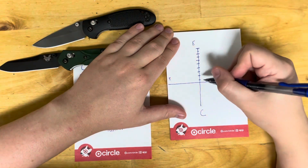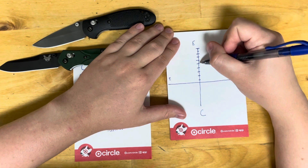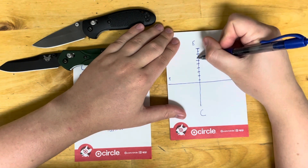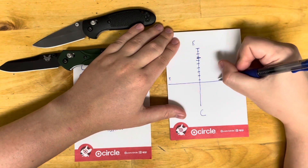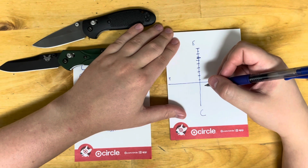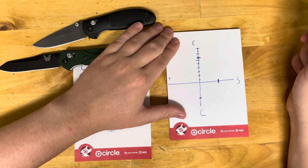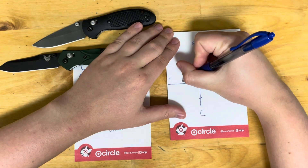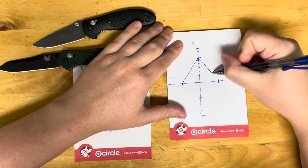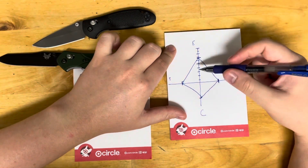On a scale where 1 is H1, 2 is like a 420, 3 is Aus8, and 5 is 154CM — S30V is about a 6.5 for edge retention. Ease of sharpening is about a 5. Corrosion resistance I'd say is a 6 or 7. Toughness is about a 5 or 6 — average if not above average. When you connect those to form the lattice, you get a pretty even, well-rounded steel — that's what you get with S30V.